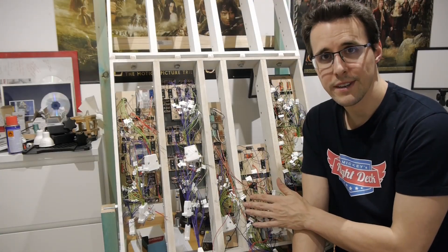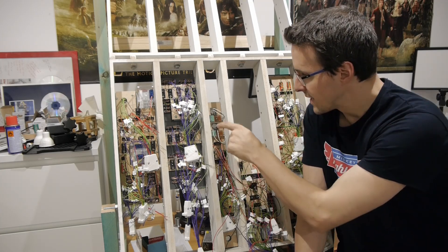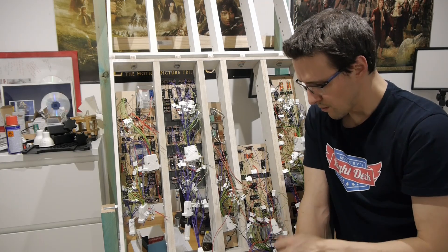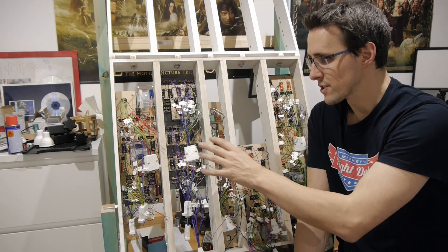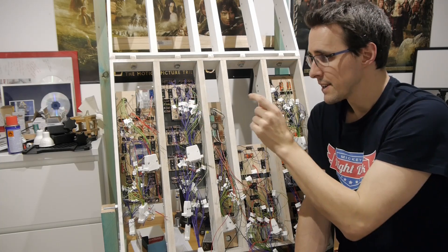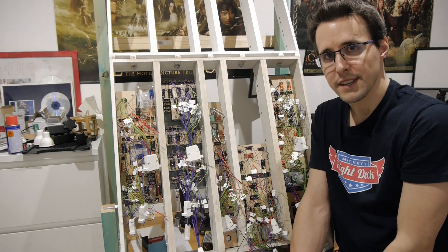Here is the backside of the overhead as it's finished until now, and I want to present my idea for the upcoming backlighting. I have connected the backlighting just rough here — the output of the dimmer is connected to the backlighting of the center panel and the bus panel, just for testing. I'm planning most parts of the cockpit to be modular, so every section of the overhead panel has D-sub plugs installed so I just have to pull the plug to disassemble. I want to connect small power connectors to every backlighting of every panel section of the overhead.